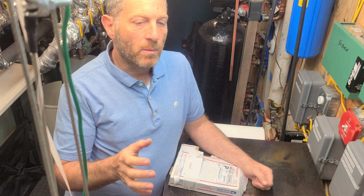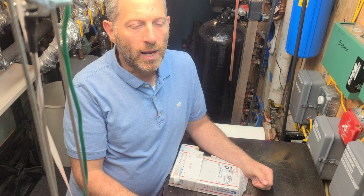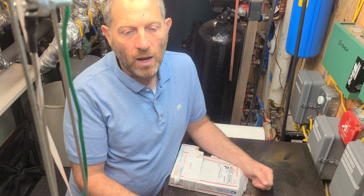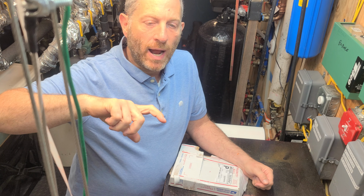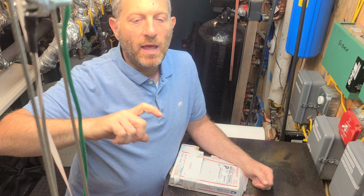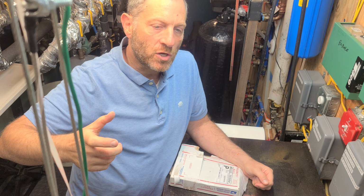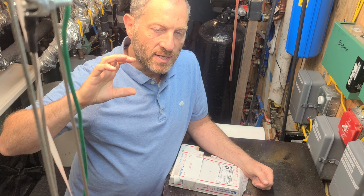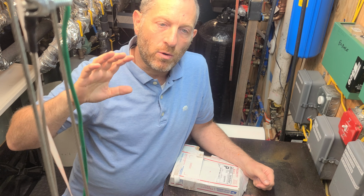in that video, because I didn't have the CAN bus, I just started throwing parts at it, and I assumed if it wasn't working right, there were two sensors. One is in the exhaust, which monitors the oxygen, and if it's too much oxygen, it's too lean, and that sensor has to get heated up to run well, and sometimes it malfunctions, and that's actually exactly what I believe was wrong, and that's what I replaced in that video, and it started running right.